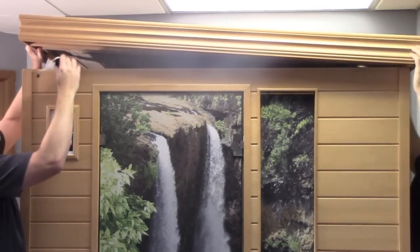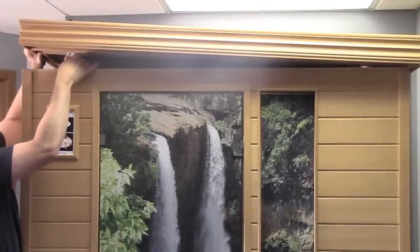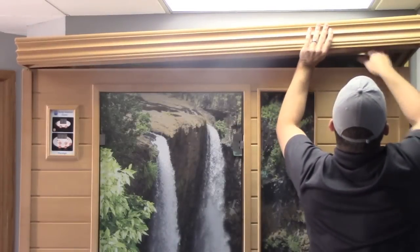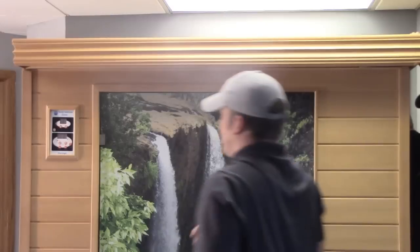Please note that there are 4 cables directly above the control panel, an 8-pin, a 3-pin, and a 2-pin, as well as a power wire that must be fed up into the roof. On the opposite side on the front, there is 1 power cable that needs to be fed up, as well as 2 power cables from the back wall in the center.